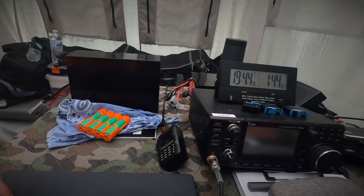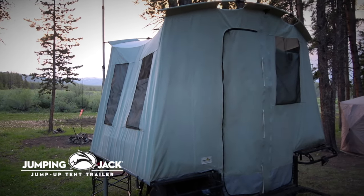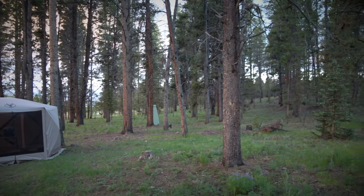As far as charging the batteries goes, I'll use a 100-watt solar panel connected to an MPPT charge controller. It's fairly noisy so I have to keep the charge controller out towards the truck — that's about 50 yards away from me on the other side of the kitchen. I keep the solar charge controller in the bed of the truck and the solar panel on the side of the truck. I'll bring the battery out to the truck and charge one battery all day while I'm using the other one. The RFI doesn't really come in while it's that far away.